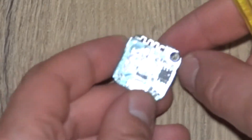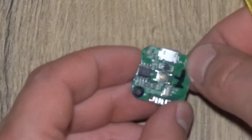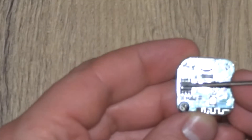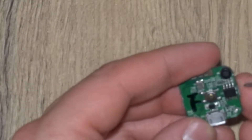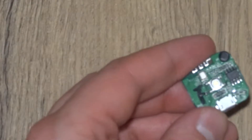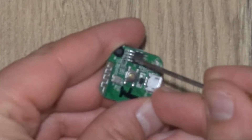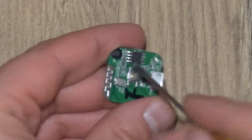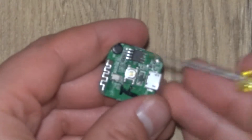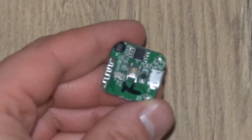You could reuse this board, but it has an amplifier somewhere here, so I don't recommend using it with headphones. Let me read what's on the chip over here. This is a mono amplifier chip — XBT1 — and what it does is amplify the sound. So you probably want to find the pin somewhere. This is the input signal on those two pins, so you could actually connect an external output over here — for example, some kind of mono headphone. So it would work quite well with our headphones from our previous video.